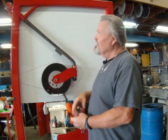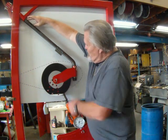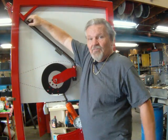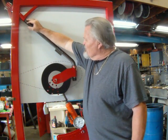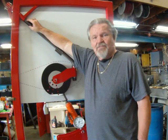Should you hit something that makes it fail, instead of the gear rolling up like a snail, it moves the point of where it bends up to this area. So it bends down as a complete unit rather than folding up. And as it bends down as a complete unit, it gets longer. The distance between the attach point at the motor mount and the ground becomes longer rather than shorter. Pitching the nose of the airplane up slightly, maybe giving you a chance to recover or react before the problem snowballs and you go over on your back. So, nice safety device that adds a little bit of smaller margin of safety to the gear leg.